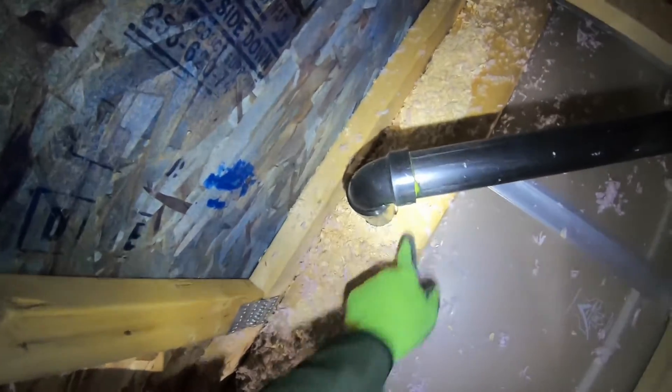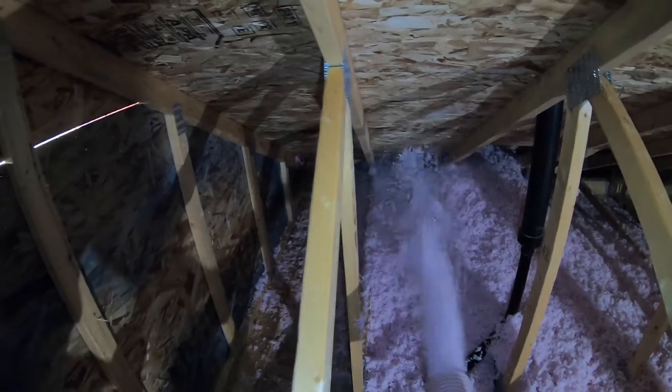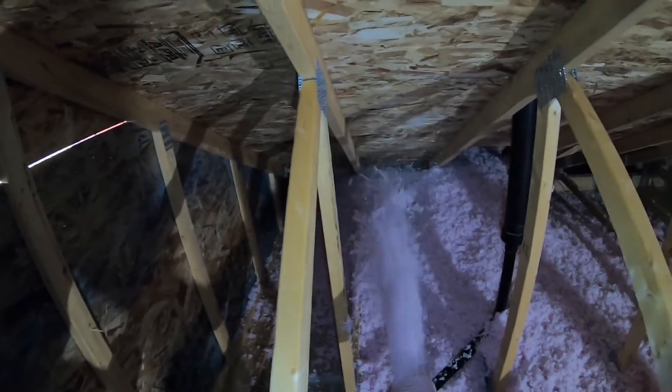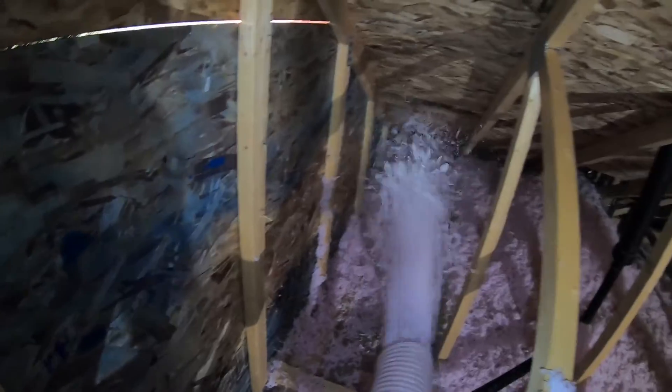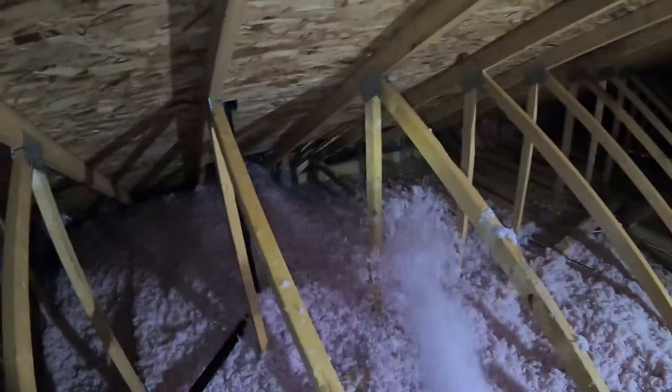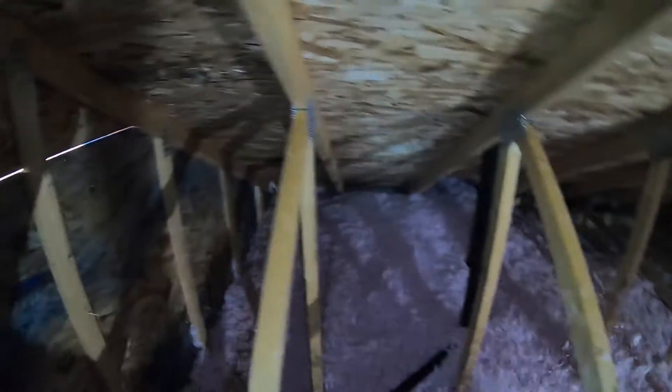You can't see it now, but on the inside this is filled — it's a can of spray foam but using a spray foam gun. Our guys use the Hilti brand and it does a really good job. It's the same type of expansion foam they use around windows, so it seals these gaps up real nice, as well as any holes where electrical wires go through for your interior walls. That's all sealed up as well to meet the Energy Star requirement.